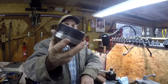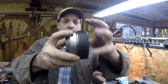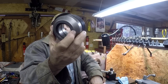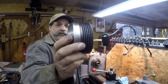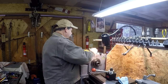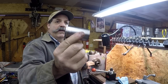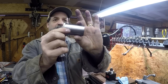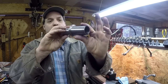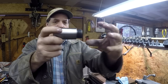It has a key, it's tapered inside here, and it has a big ring nut that goes on here to hold it on. This has two uses — it protects your spindle for one, and it keeps that ring nut from flopping around. It spins with the spindle. The other part of the collet setup is this sleeve. The spindle is a 5 Morse taper spindle, and the inside here is machined for the 5C collet to go into. There's a little keyway to orient it and keep it from spinning.